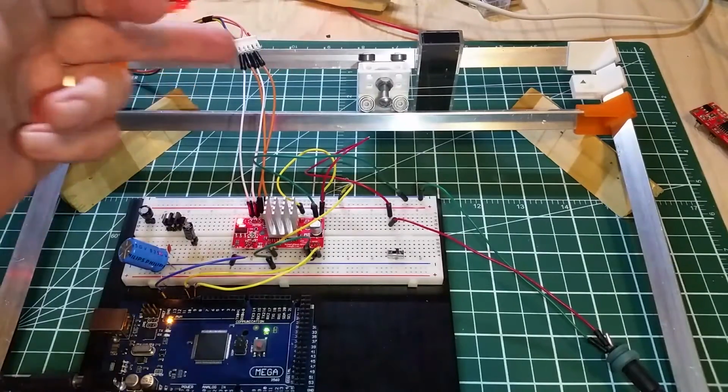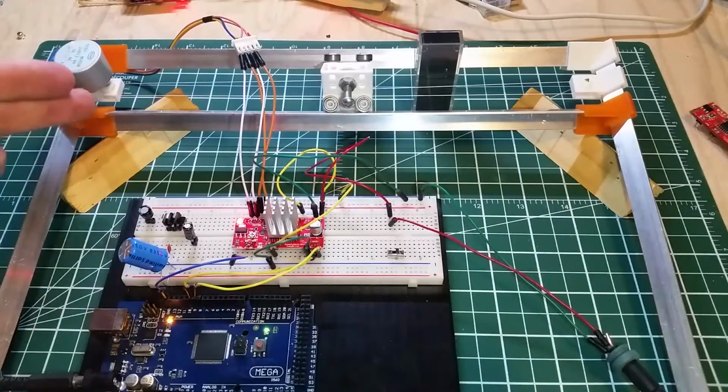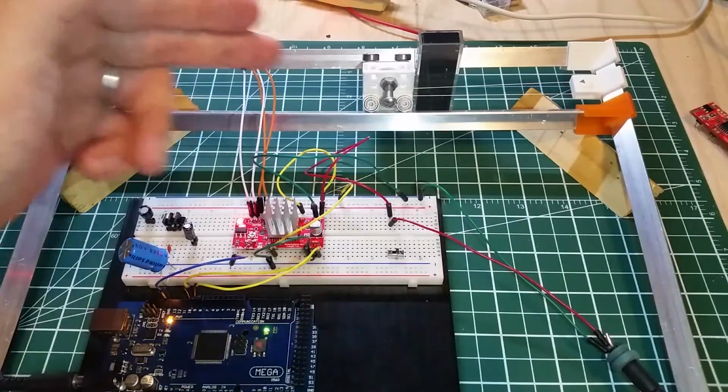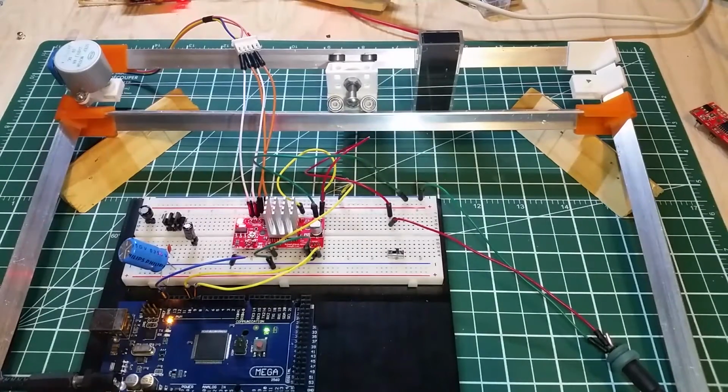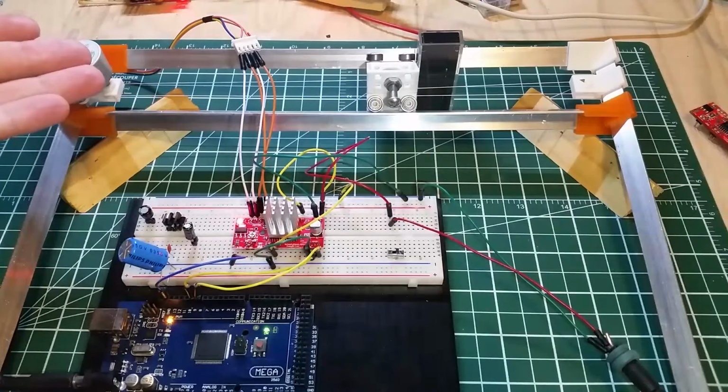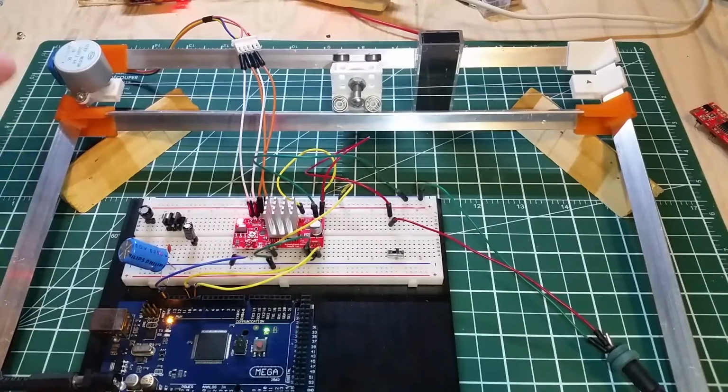Again, the distance you're seeing this carriage move, because that's a 1 centimeter pinion, is based on 1 RPM of this. That's the travel you get. Perfectly good for a laser when I have this over top of the shell of a flatbed scanner or a different axis. You could easily use a laser with that. It's not going to be terribly fast, but I wasn't going for that. I could always use one of my other stepper motors, something in the larger NEMA family. But anyhow, that's the update.